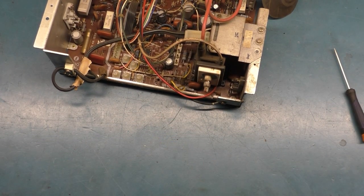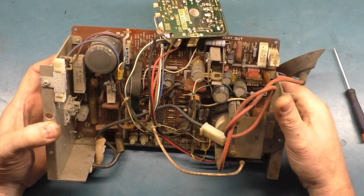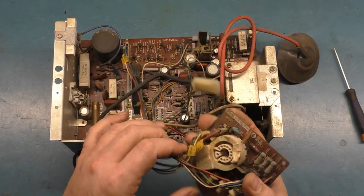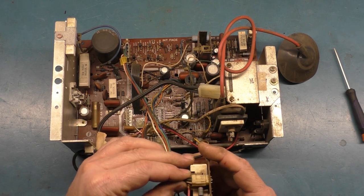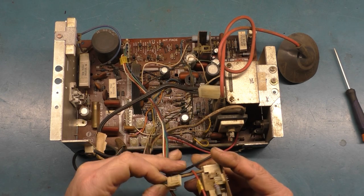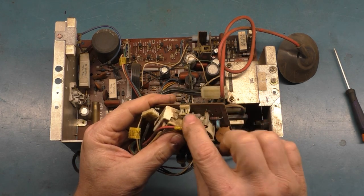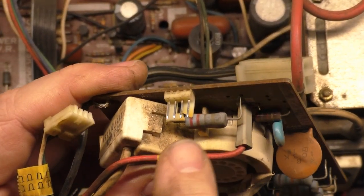Let's get going on the time lapse. You can witness and watch and follow along with the cap kit and the reflow. And I always suggest this connector here likes to get crispy on the neck board. So I always suggest taking this off of here and kind of cleaning up the... Yep. Speak of the devil, just disconnecting it, the black white plastic here, the back, that cracked and broke.